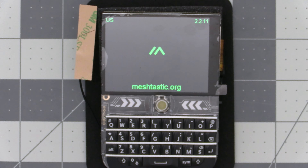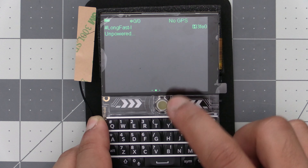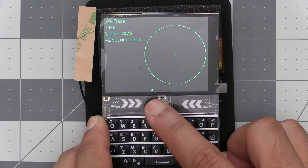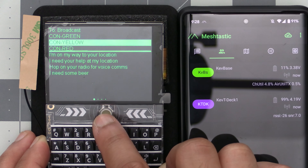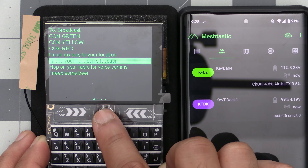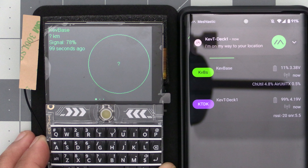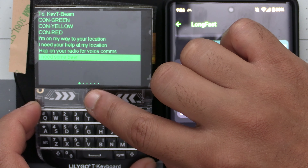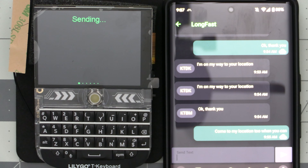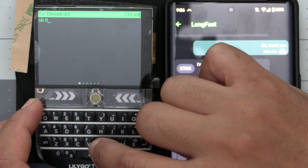After the device boots up you're presented with the usual screens that you may be familiar with if you're using MeshTastic on a device like a T-Beam with a screen. You can use the trackball from left to right to cycle through these and see the last message received, other devices seen, channels, etc. If you move the trackball up or down instead of left-right you'll be presented with the canned messages screen, where you can configure a list of pre-configured messages to select and send. You use the trackball up or down to select the message and left or right to select who you're sending to. After that you can send by either pressing in on the trackball or hitting the enter key. I've found the trackball to be a bit sensitive and prone to changing who you're sending to as you press it, so it's best to just use the enter key instead.